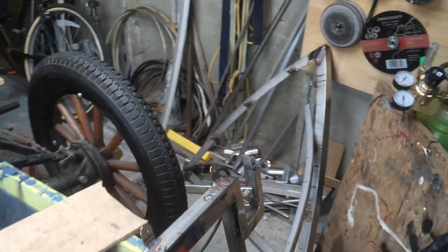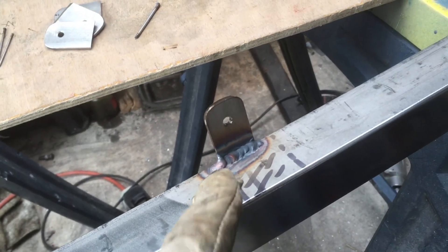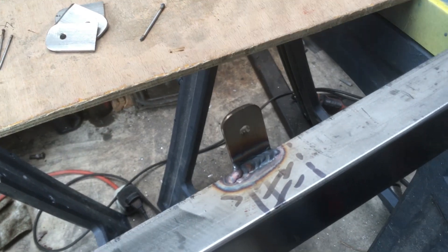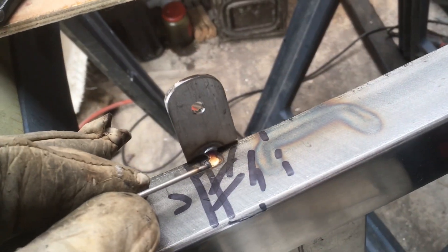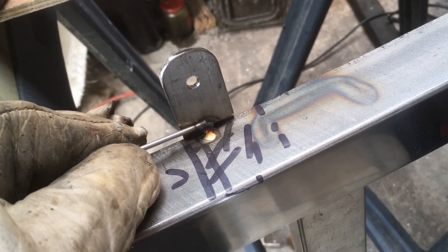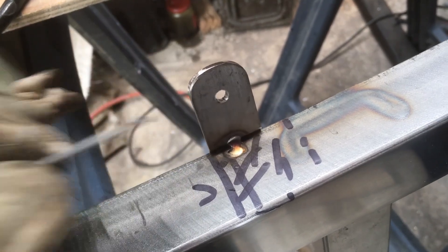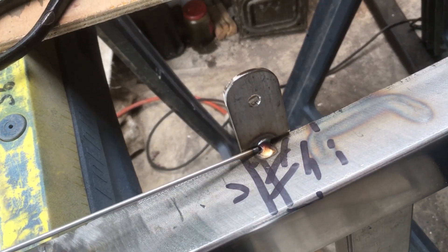These are the sides for the boat tail — the angle iron I've bent to shape using my tube bender. I'm welding little tabs on here on the underside of the car, because I'm going to put two pieces of wood, one glued to the other, chamfered to a nice curve so you don't have a straight edge on the bottom. Since I've put a bevel on them and TIG welding gives you only two hands, I rest a bit of welding rod to make the initial tack, break it off, then feed rod with one hand and hold the TIG torch with the other.